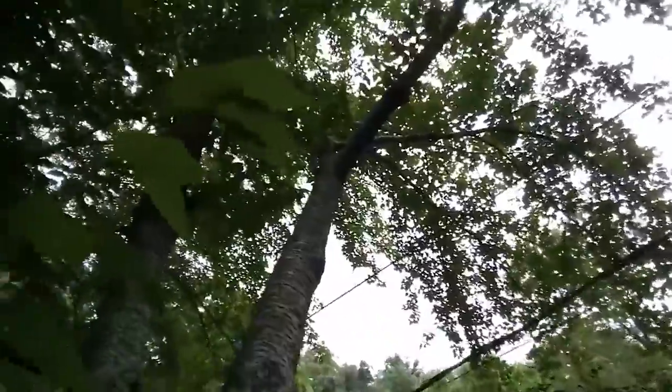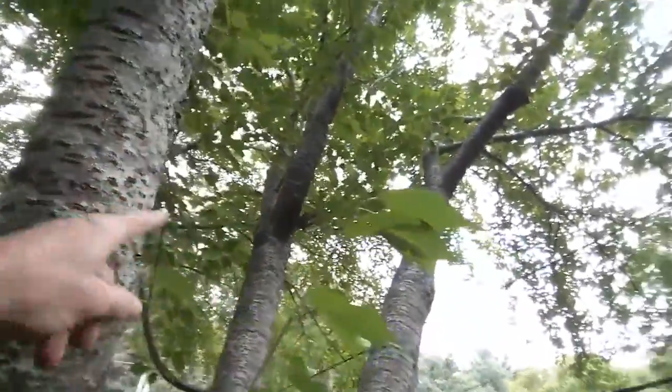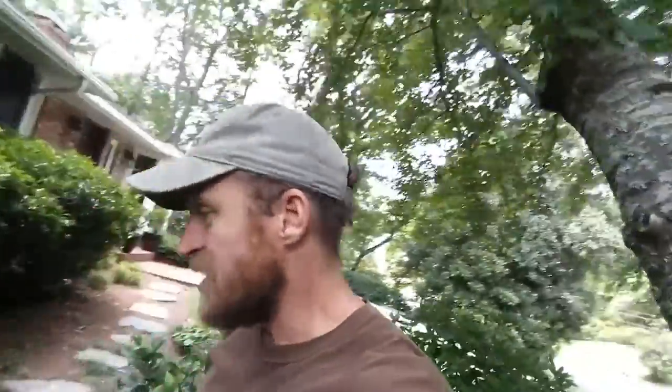In contrast, right up there on this tree, you can see they left a stub. Don't leave stubs, because stubs will die out and then they'll actually cause knot holes. The little stub is dead, it'll start decaying, and the material will try to round over — and again it'll cause the same thing as those other big knot holes.